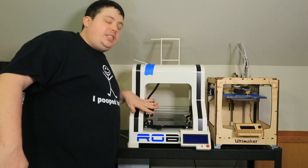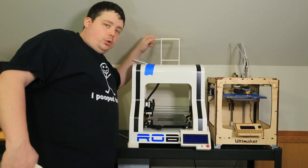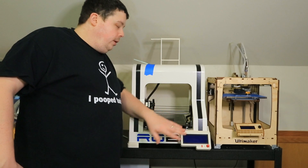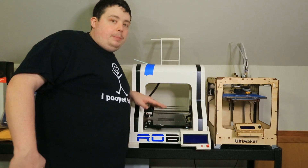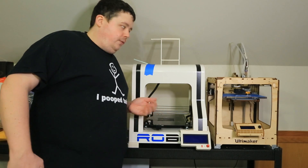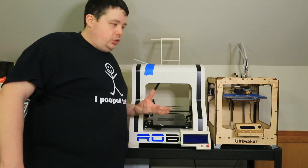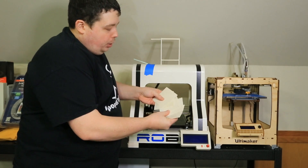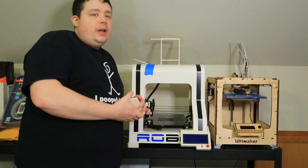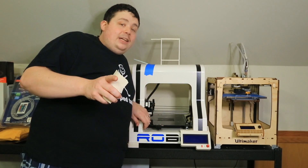Case in point today, the Robo 3D — you've seen me print tons of upgrades for this thing on itself: the LCD controller, the stabilizers, even the spool holder up top. But when I tried to do longer prints with the extra load on the power supply and the Arduino board using this LCD, it was just too much. After about 30 minutes the unit would crash. I felt under the printer and the RAMPS — the stepper motor drivers — were super, super hot. Every time I tried to print an object with a large surface area, it would only get to about two or three layers before crashing. I figured it was a heat issue, confirmed by the forums.